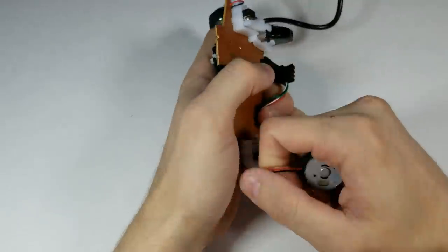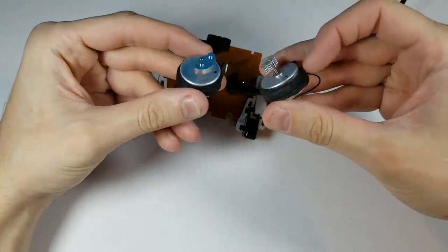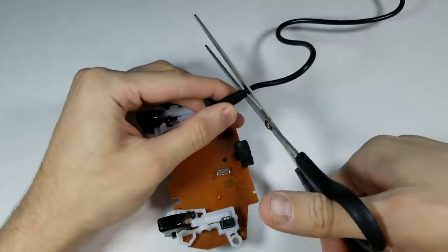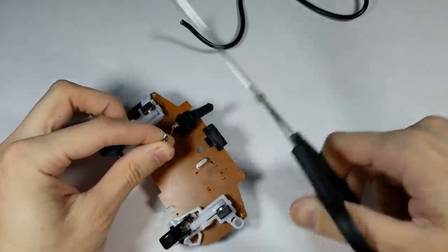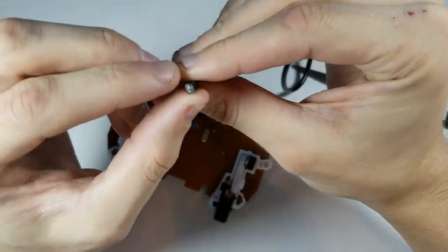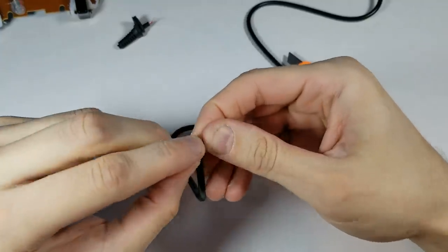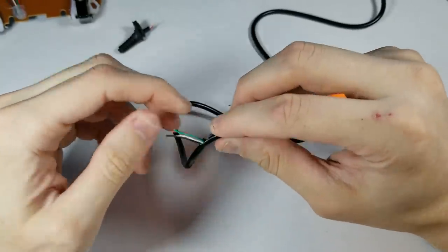I still needed quite a bit of room for those large mouse movements required while gaming. So, we needed to remove and reallocate every single face button on the controller to either the backside or the edges of the controller. Taking inspiration from the Pro Controller scene, we decided to place the A and B buttons on the backside of the controller, which could easily be reached with your middle or ring finger, and the X and Y buttons to the top side of the controller, right beside the triggers.